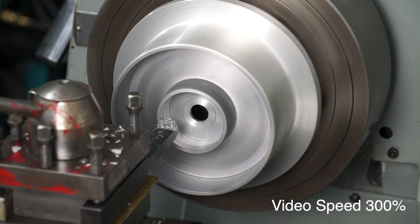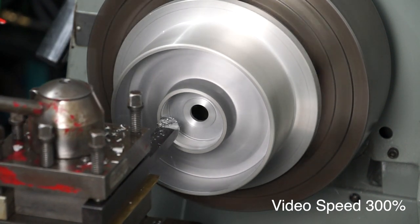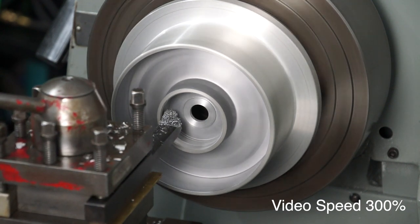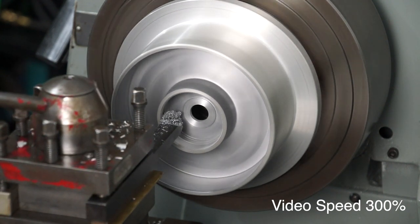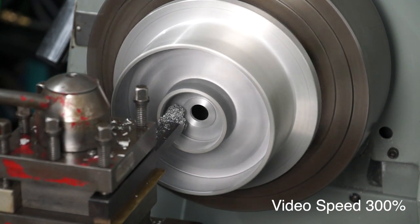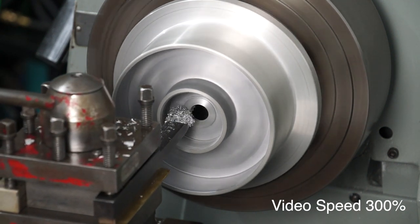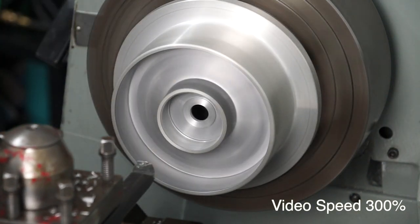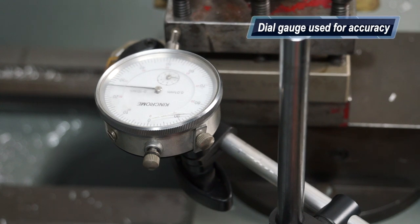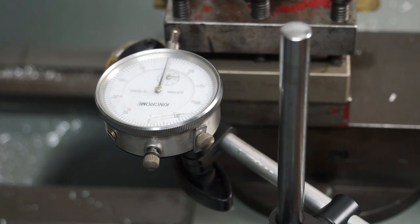I've sped the footage up a little bit here, because otherwise we'd be machining for 10 hours and I don't think you've got the patience for that. Just a light skim here to get close to where I want to be. What I'll do now is use my dial gauge on the cross slide — I don't have a digital readout, so this is where I obtain my accuracy from. My Colchester lathe is all in Imperial dials.